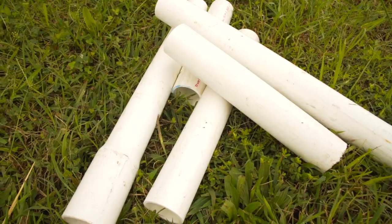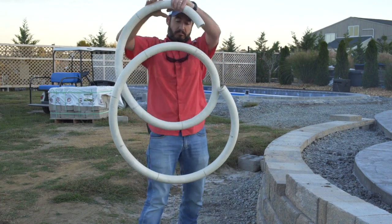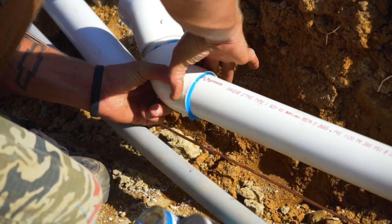Those are the four most common, troublesome, and expensive problems we dealt with until Rhino Rock construction was put into place. But we also assessed our installation methods to determine if there were any other problems we could prevent. For instance, you want rigid PVC over flexible PVC. The two products are made with similar materials, but the additive that makes flexible PVC flexible is what makes it attractive to critters like termites and rodents underground. Flexible PVC is actually not even rated for underground use, so the Rhino Rock solution against termite and pest damage is rigid PVC.